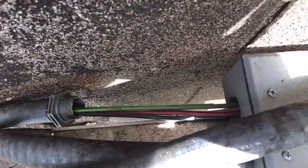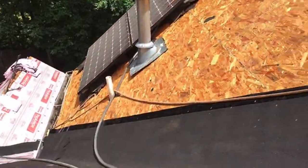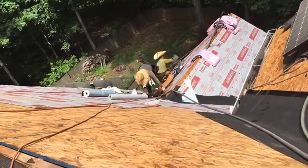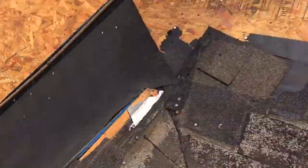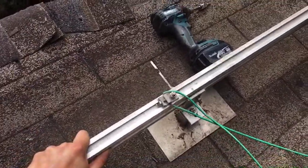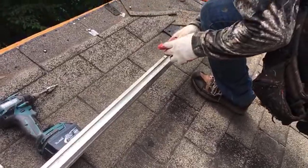I'll show you that right there — looking real safe, 240-volt AC on the roof. We're going to fix it all and put it back. I'll be showing you guys more as we go through and fix this thing. We'll try to get the conduits up off the roof and support it as best we can. We're not going to come back with the quick mount flashings — we're going to be using Solar Roof Hook, because we love it. We'll probably rerun the ground and re-hang all the flashings and all the panels.